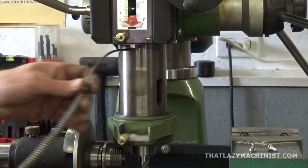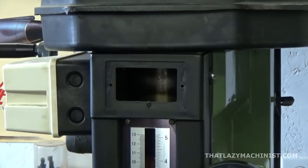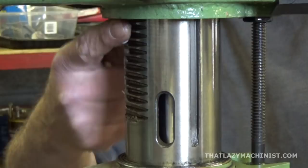Let's get back to our mill mods. I've received a few questions about quill and spindle lubrication. If you lower the quill to its bottom point, you can access the bottom portion, and to access the top, just remove this cover. The spindle itself has sealed bearings and they're best left alone. The quill has a rack gear on the back of it, and if you lower the quill to its lowest point, you can lubricate the rack by applying a small amount of grease.